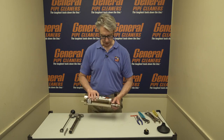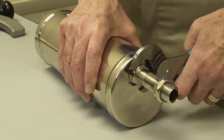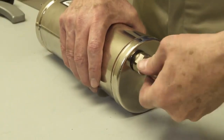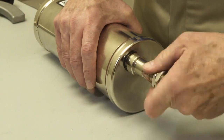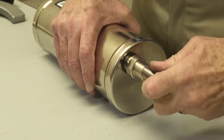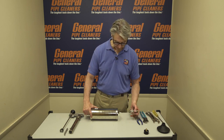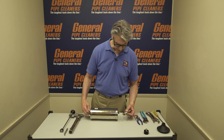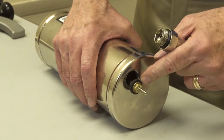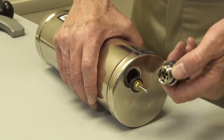Let's take off the shank at the bottom of the air cylinder. Keep an eye on it and keep pressure on it as you're taking that off, because it can pop — and you don't want to lose any parts. Now you have an O-ring here, which is very important, and you have a gasket right there. Both are very important for the functioning of the trigger to make sure it's efficient. Change these while you're in here.